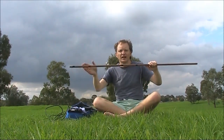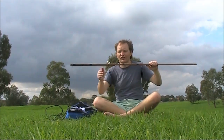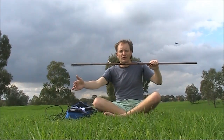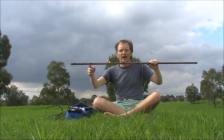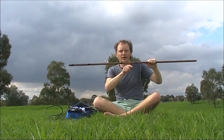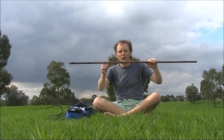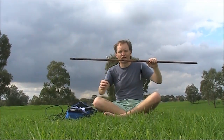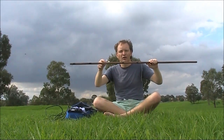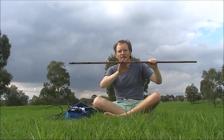This, for example, is a bobtail for 70 centimetres, or 432 megahertz. The same dimensions as before: quarter wave length, half a wave length, another quarter wave length, half a wave length, and a quarter wave length. The feed point is in the middle, with the centre conductor going to the vertical element, and the outer conductor of the coax connector going to the rest, which is basically shaped like the letter C.